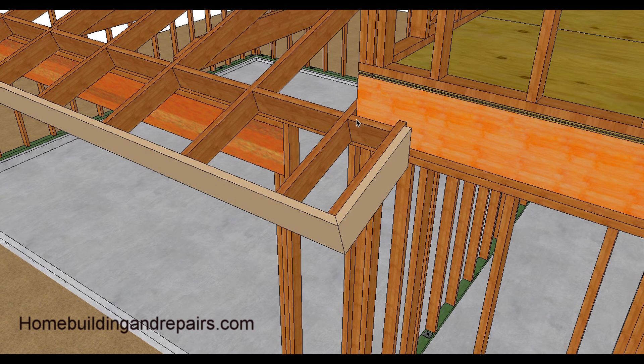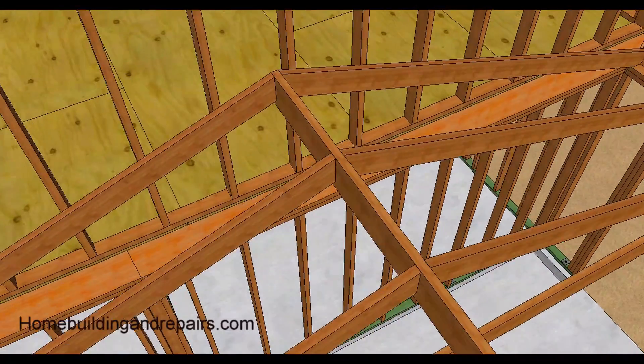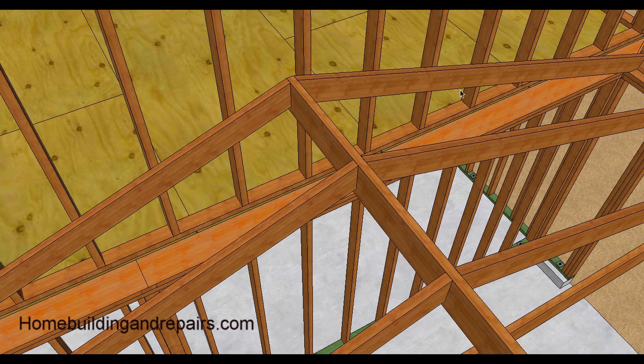The reason they don't run it straight across is because of roof leaks — water could run off the edge. But this extended approach seems to be more common practice, and that's what I'm drawing here, stuff I've built plenty of times before. Here's the rafter and the ridge rafter attaching to the walls.